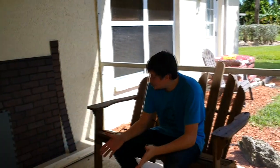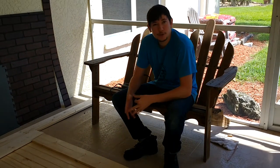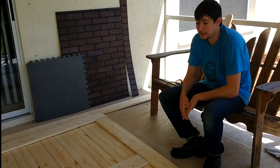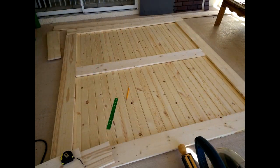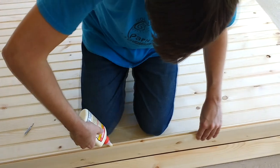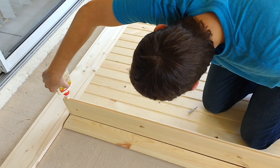The door is finally coming to completion. Everything is still loose right now, but now that the whole framework is cut, we're going to start gluing it together. The main idea was rather than gluing half and then risking having to move it and then glue the actual frame on, this way when it dries it's done — the whole door is done, besides the decorative pieces. We can have full confidence lifting it up and bringing it in the house. We're using wood glue, and after we have it glued we're going to screw it together in a few places. I didn't want all the screws on the front of the door, but for practical sturdiness I want a few.